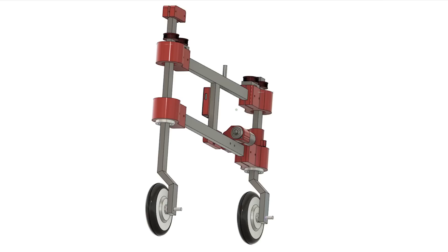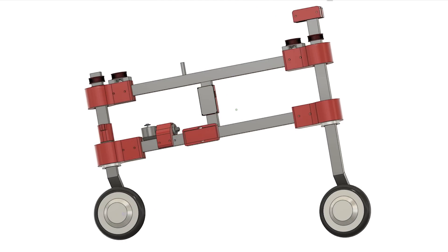In this video I'm going to make a bike which has both modes of steering. I need to make sure both wheels steer at the same angle so the wheels don't try to drive apart from each other, so I'm going to apply the leading wheel geometry to both wheels so they both point forwards. I'm also going to make this a two-wheel drive e-bike so the wheels can maintain the same velocity and one doesn't lag the other.